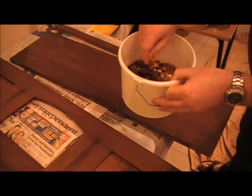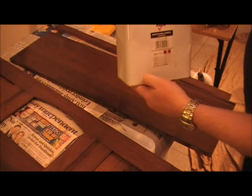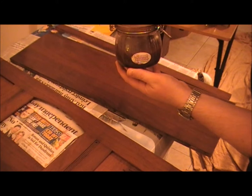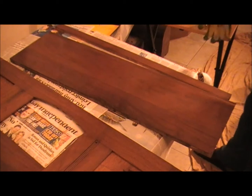This is what they call button flake, and it's what you use to make French polish. It's shellac, and you dissolve it in what we in Ireland would call methylated spirits, or in other places in the world called denatured alcohol. You put it into a container like this one, pour it over the flakes, leave it to dissolve overnight, and you're left with your French polish.